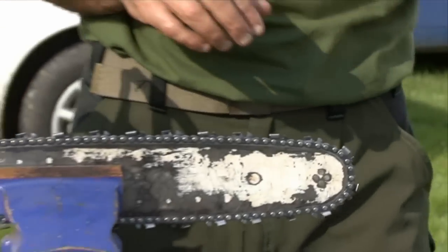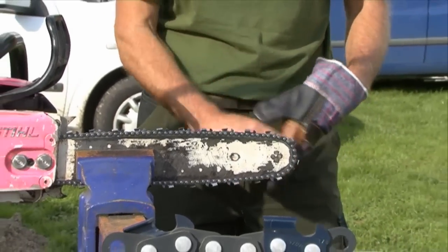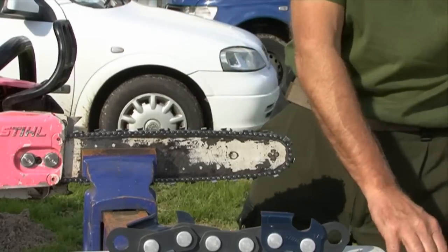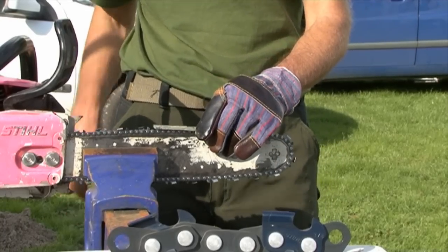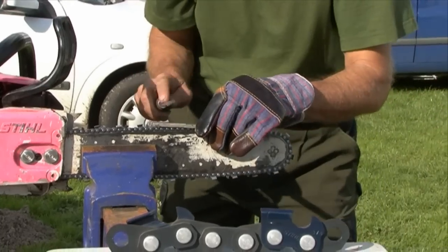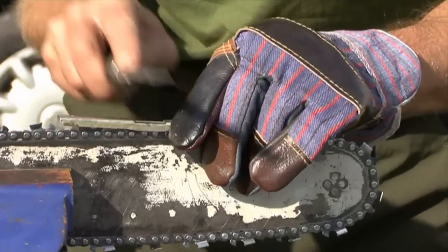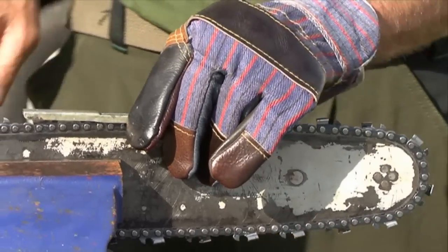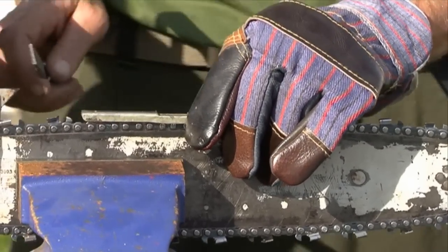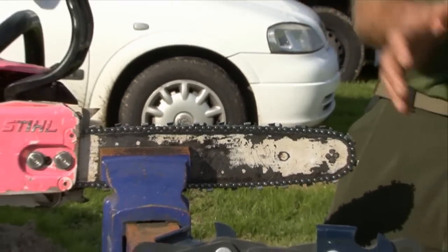While we're on this side of the chain, we're going to check the depth gauges. They're important — that's the amount of cutting the chain will do. If the depth gauges are too high, the chain won't cut. So we need to check those by putting the depth gauge tool over the chain with a flat file. If they need filing, they will protrude and you'll be able to sharpen them. Each tooth has its own depth gauge, so you work all the way along one side of the bar. When you've done that side, you rotate the bar and the chainsaw and do the other side.